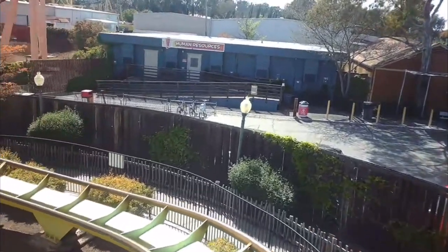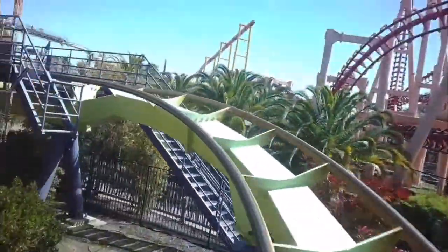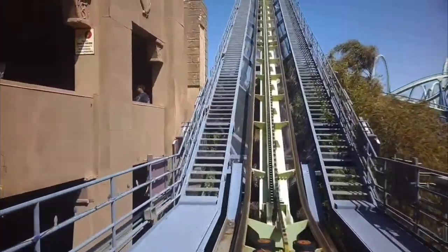A lot of rides have that fun little dip down right before you get to the lift hill. So it's B&Ms, a lot of times they come out of the station, they make a dip down as they go. Old Arrows used to do the same thing. They'd have this dip and a little flat spot, and then they would go up on the lift. Well, that is to put train inertia into the train so it can make the lift, because what happens is that your lift hill is sitting flat like this. Well, the chain on a lot of rides, not all of them, goes straight.